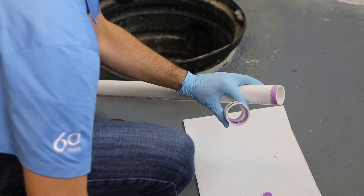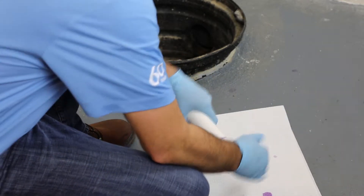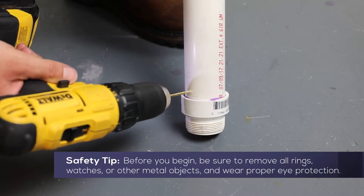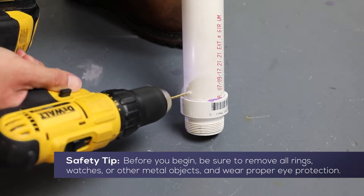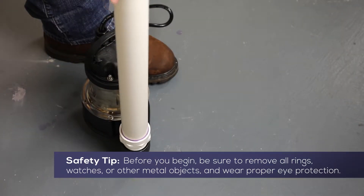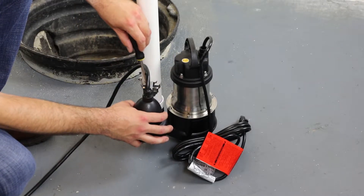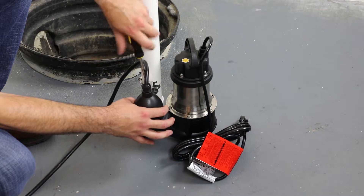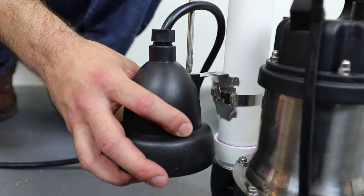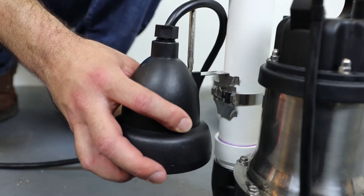To begin, assemble the PVC piping as required for your sump pit. It is recommended that you drill a 1/8-inch anti-air locking hole in the pipe just above the pump discharge. Mount the ION Plus switch at the appropriate level on the discharge pipe. Be sure not to mount the switch lower than the inlet of the pump or higher than the inlet drain tile pipe in your sump pit.